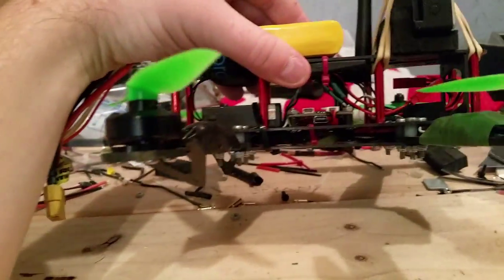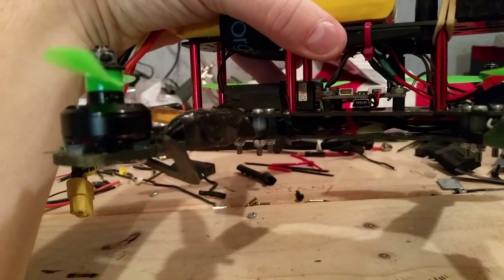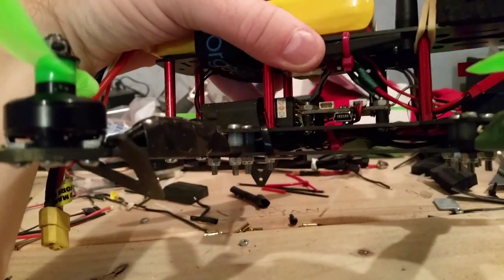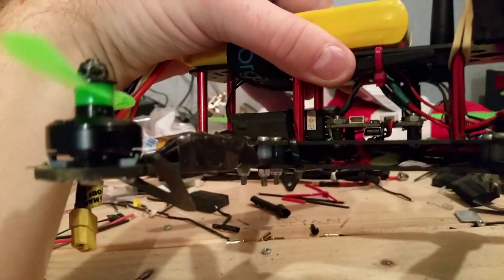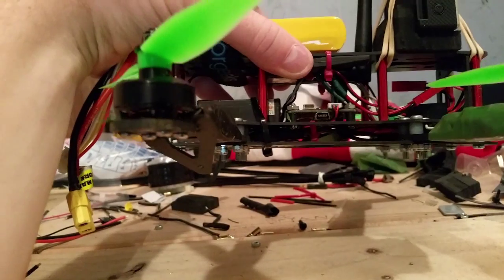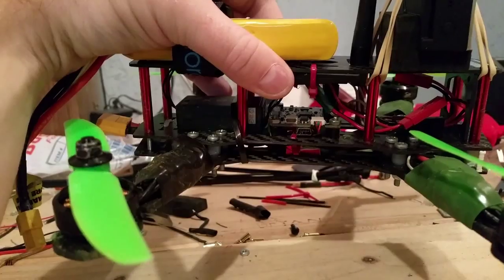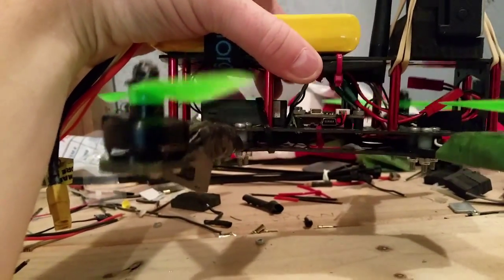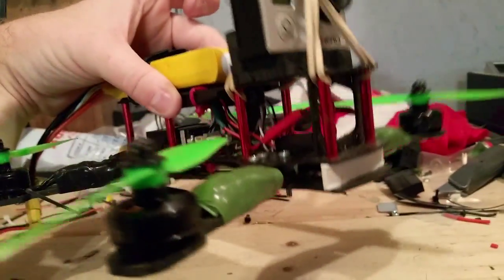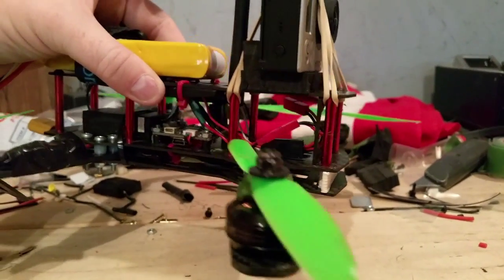One of the mods I did was I went and bought some nylon spacers — these are 3mm by 20mm screws — and I put a little spacer in between there because it was crushing the cables. The power cable was touching the board, squishing and clamping the wire, and it was shorting out, so I changed that. With my 3D printer I printed one of these bumpers. I'm not so sure I like it yet, but we'll see.